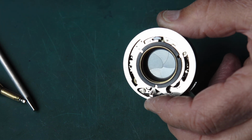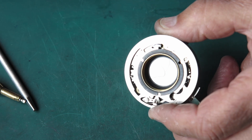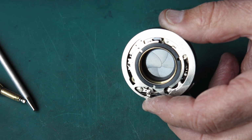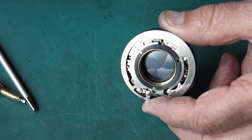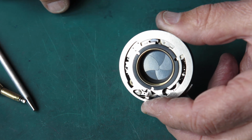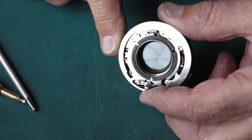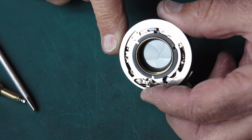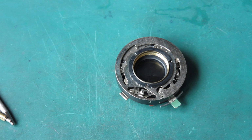But it's certainly quite achievable to get them within specification quite well, and if it's all clean and well serviced and nothing is damaged in there, you could probably get your speeds to within 10% fairly well, which is more than enough for film. I mean, 1 stop is double or half the exposure time, so half a stop is proportional, 0.7 or 1.4. Anyway, let me check this.